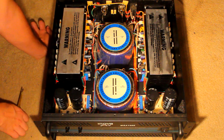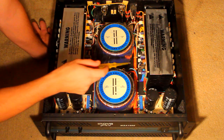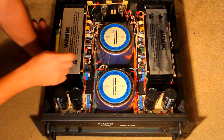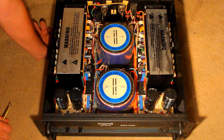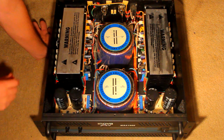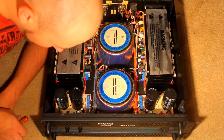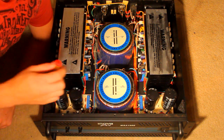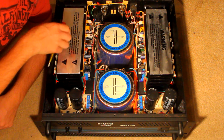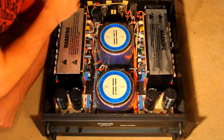I like it. And then you have the amplifier guts here. You'll have the drive boards, and then you have the transistors, which will be mounted to the heat sinks in here, and the fans mounted to the back. By the looks of it, we have the two transformers. They then go into a rectifier or voltage adjustment circuits here, regulation circuits. These are internally fused. They have fuses in there, which is an added safety measure. So one identical each side. These then power the drive boards here, and this will take the input from the rear, amplify it, and then the output goes to the back.